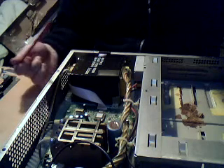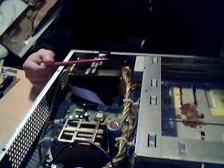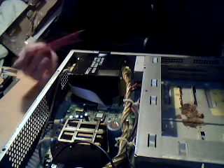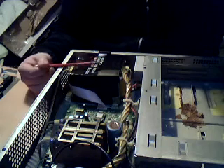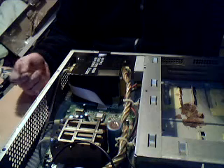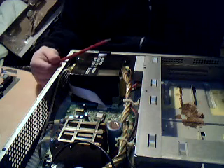This great big black thing here is a transformer. This transformer has two primary windings and one secondary winding. The first primary winding is for the inbound mains — that's the stuff that comes from your wall sockets. The second primary winding goes out to your devices that you want to protect. The two primary windings are identical. In normal operation, the primary winding sets up the flux field around the transformer which induces voltage and current in the second primary winding for your devices to draw off.